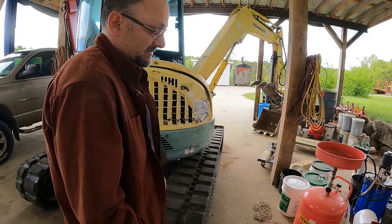Going to tell. Note that when I'm holding the lever forward and turn the engine off, it immediately goes to zero. So when the engine shuts down, a dump valve opens to the tank and all hydraulic pressure immediately goes to zero, making it basically impossible to see any leak down. So my only chance of seeing leak down is to have the lever forward while I go from full throttle to idle. It's actually reading a little bit high, but when I'm at low idle, it's giving me 3,500.